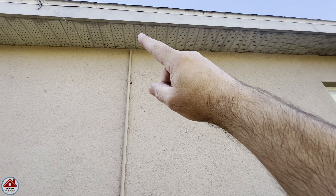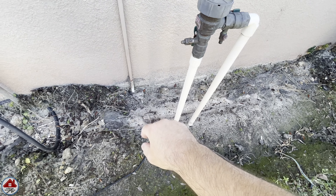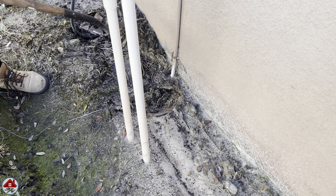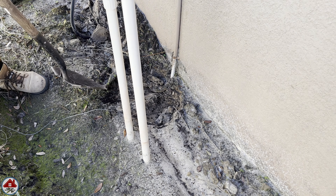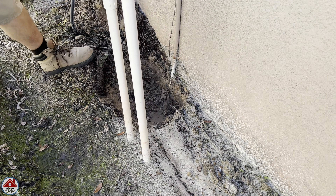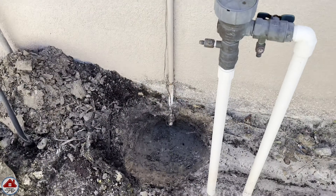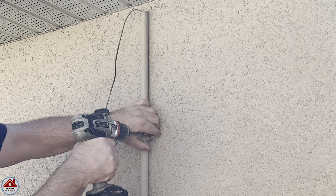When you're doing these projects, you just start working on it and see how it all develops. My next move is to dig all this dirt up to expose the end. Once that's done I got to decide how I want to run the wires to hook it all up. This dirt is tightly packed because it got wet then dried. I work at it — chopping at it, breaking it up, then scooping it out. I see the wire so I lift it out of the way, then make sure the hole is deep enough so I have clearance for the new wire. I'm removing this rain sensor because my smart sprinkler controller gets the weather forecast from the internet so it's not needed anymore. I cut the wire, take out the two screws holding the bracket, and it's detached. I remove the top strap and pull the old wire out of the conduit.